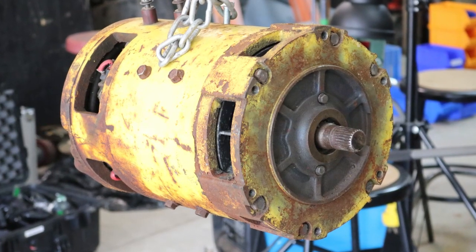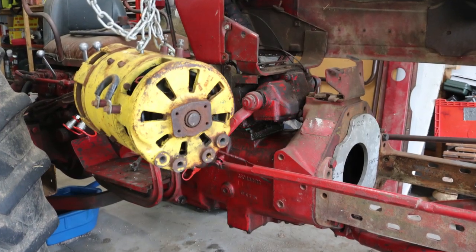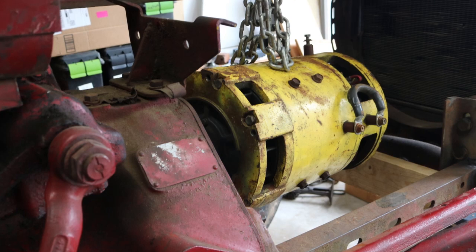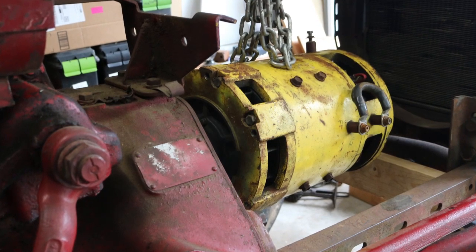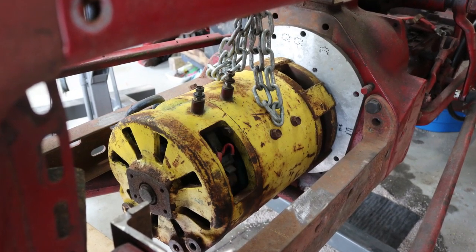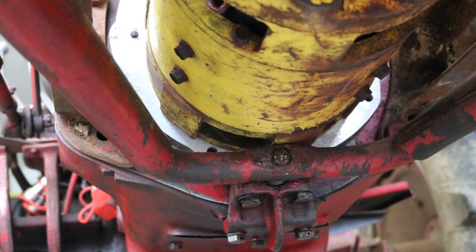Since I've got this motor on the engine hoist I'm able to put it into the tractor and get some rough spacing on it — just put it down about where I'm visualizing it will go. It doesn't have to be perfect; I'm really just looking for the spacing and checking if anything is obviously going to hit. Overall it looks pretty darn good — it actually clears that yoke at the bottom of the tractor, which was pretty important. There also looks to be plenty of room around the motor for the bolts that will hold it in place and connect the adapter plate to the transmission bell housing.